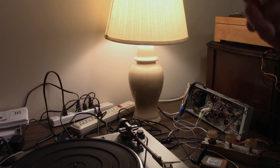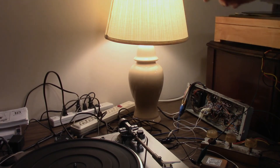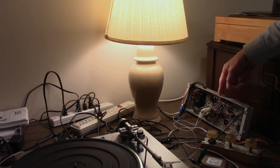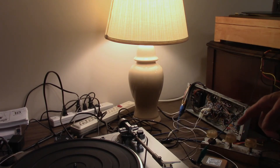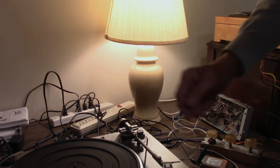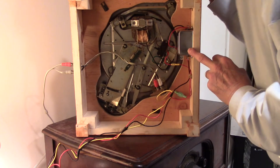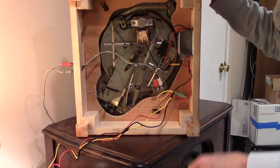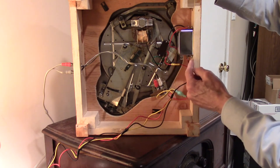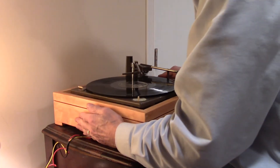I went through a whole long process — I don't want to think about how much time I spent trying to figure this all out. I've mounted my little EMI filter box under here. The two wires coming from the turntable go in, and two wires go out to the amplifier, plus my ground wire soldered on there — this wire goes to the ground on the chassis here. And that fixed all of my problems.